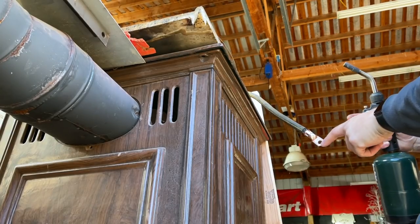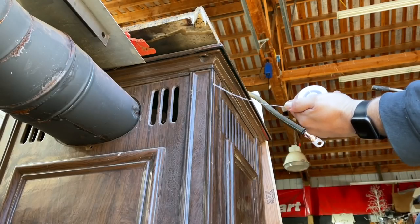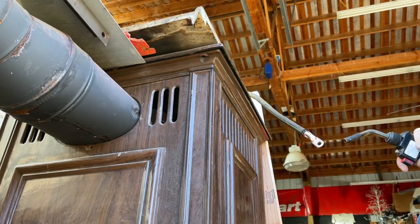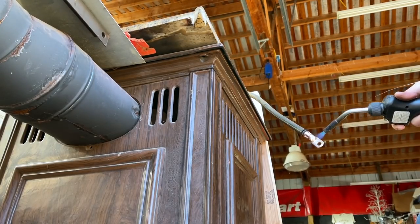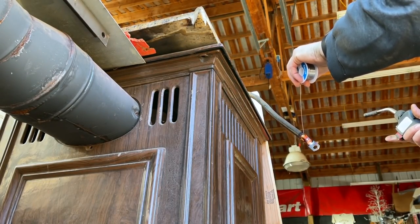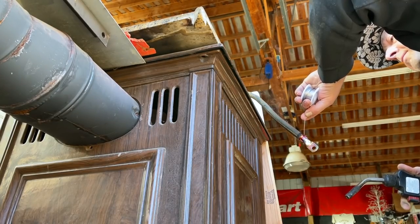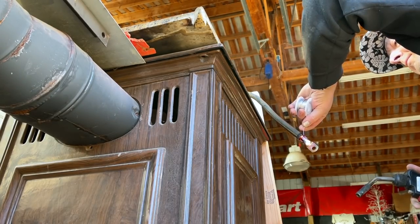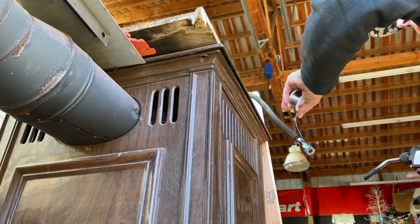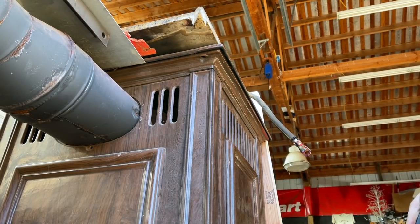Now we're gonna take our torch and heat just the end of this. We're not gonna get anywhere near the top of the wire. And I've got some 60/40 rosin core wire we're gonna use, which has a nice low melting temperature. And you can tell we're heated up enough when the flux starts smoking. Then basically we just load a whole bunch of the solder in here. Basically we just keep putting this in here till the solder kind of fills up to the top, and then we should be good. Let that cool for a while, and then we'll have a nice solid connection.